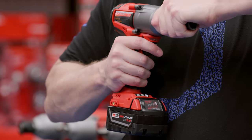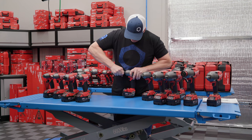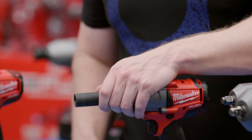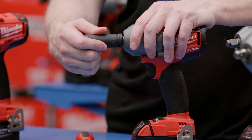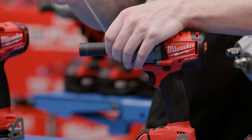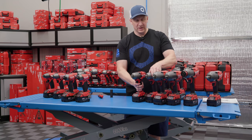But the problem with this is that, especially the pins on the Milwaukees, you have to push it in. You can't pull it off. It doesn't come off. And so what I always end up doing is grabbing a pick because it locks it in place. You can use a little flathead if you wanted to. But I generally grab a pick tool, reach in there, push the pin in and pop it off. I'm sure somebody's gonna say in the comments, I've been doing it wrong my whole life. You could put it on without putting the hole in place. But I don't think there's any way to get this thing off. Is there some special real man technique that I don't know about? I'm always having to put something in there, push the pin back so I can remove the tool or remove the socket.